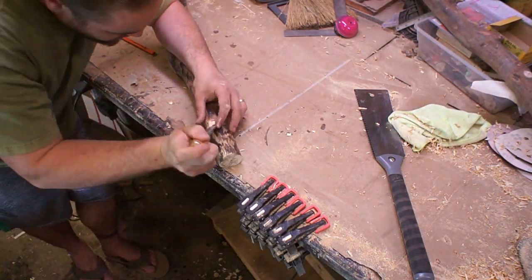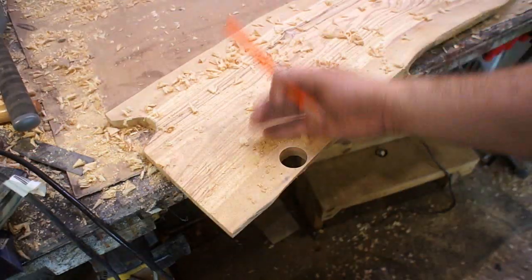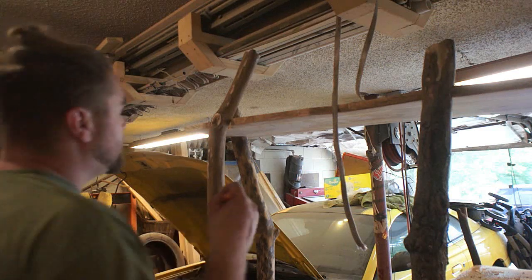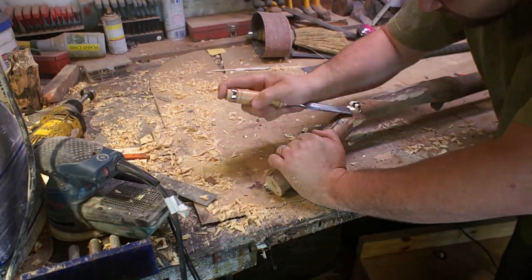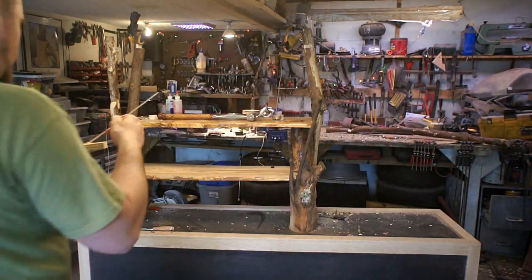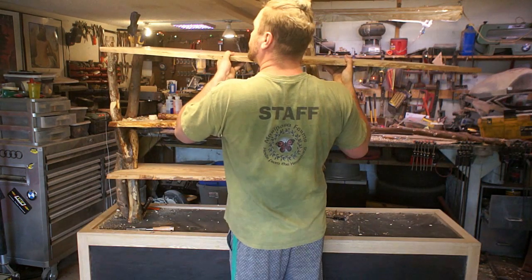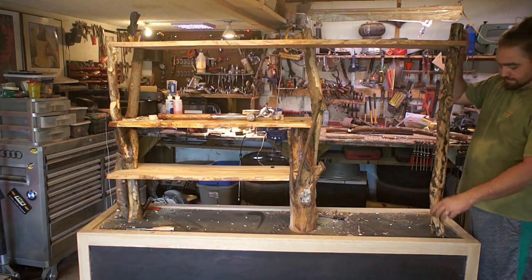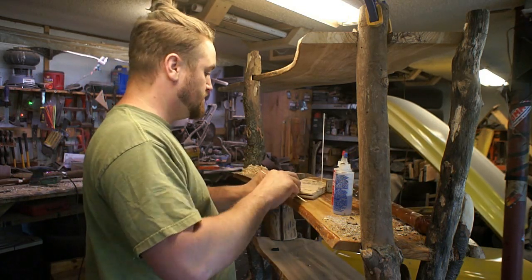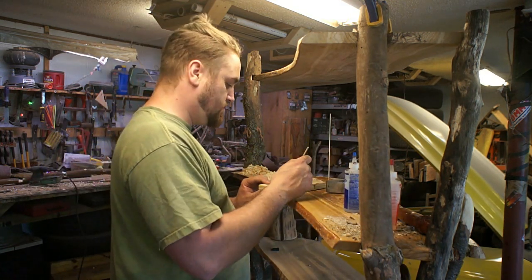Carving another interference fit for the upright, then coming back to make the next hole up through the top piece. This one had a funny bend at the end so it was a little interesting to carve out the shelf — I had to remove a lot more material on one side than the other. The fit on top wasn't as precise, which is why I'm using epoxy. With so many joints going together at once — four on this section — the tolerances were a little bigger, so the epoxy will fill in the gaps and still give it strength. For those larger gaps I'm also mixing in wood shavings of different sizes with the epoxy to fill in anything that was a bit too big for my liking.